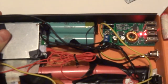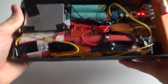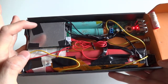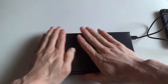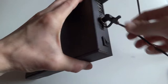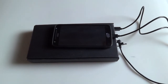Another reason why you shouldn't do this the exact way that I did: the wiring in this setup is not very good. There are wires going everywhere, and it could lead to a short circuit if any of the wires get exposed. Also, the enclosure is made out of cardboard, which is probably not the best idea because if there is a short and it causes a fire or the batteries explode, that would just create a larger fire. A metal enclosure would be the best, but that may be hard to find.